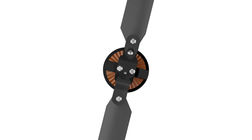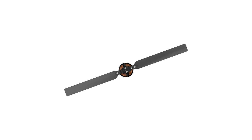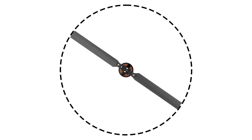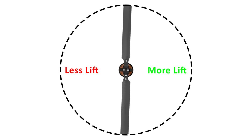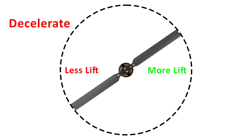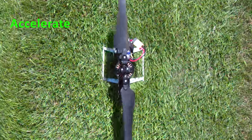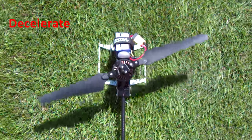The difficulty arises when we realize a helicopter adjusts its blade pitch every rotation of the rotor head. So say we want more lift on one side and less on the other, the motor will need to accelerate for half the rotation and then decelerate for the other half, causing the blades to swing back and forth, which could be up to 80 times per second.